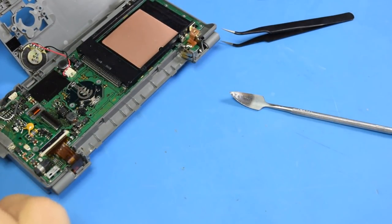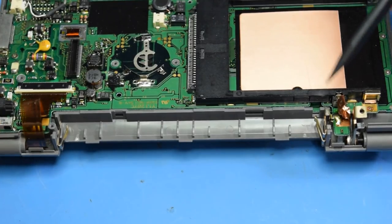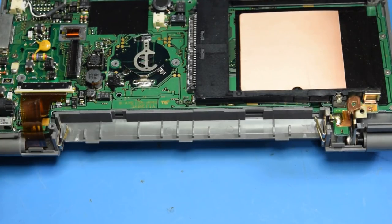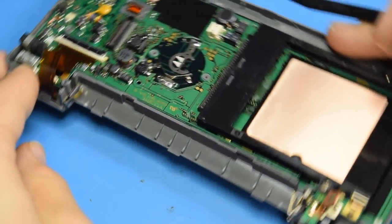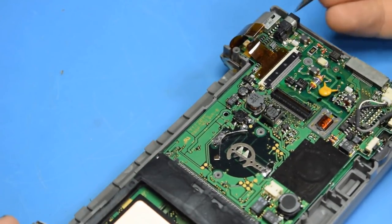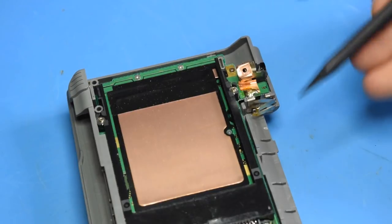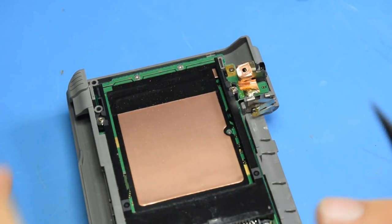All right. We have access. After looking this over, it's fairly obvious that this pin is ground because it immediately goes to this ground plane, and you can test the continuity anywhere. But I do believe that this pin is for 2.4 volts. If we follow it immediately, it goes to this 5 amp fuse just like the power input does over here. That would mean that this pin is a 1.2 volt sense pin for the battery.